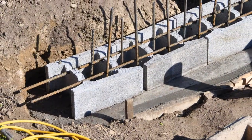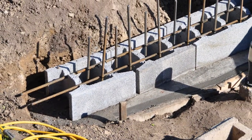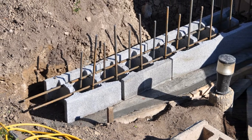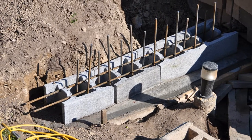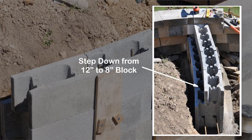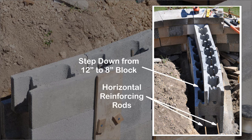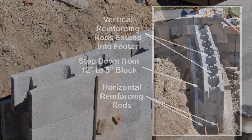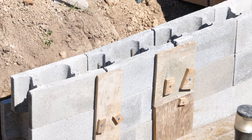The footer has been poured. The lip is important to support the rock facing. Vertical rebar was inserted into the footer in roughly 8-inch intervals. This portion of the wall is three blocks high. The top layer of block steps down from 12 inches to 8-inch block, which reduces the wall looking too massive once the cap rocks are in place. Using the 4-inch rock facing will decrease the width of the cap rocks back to a good 12 inches.